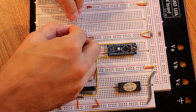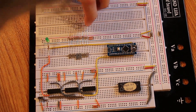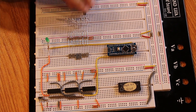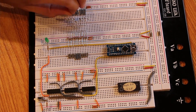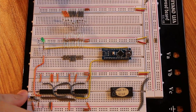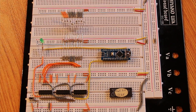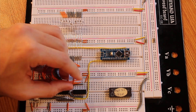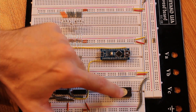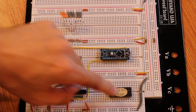The backside of those LEDs all need to go to ground. Now that we've got the LEDs in place, let's get the binary count output from these three chips connected up. Now we need to start hooking up our ROM chip.